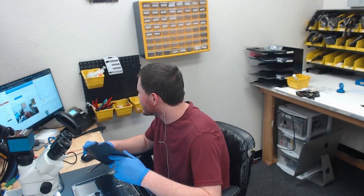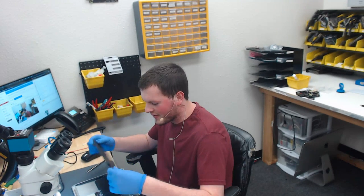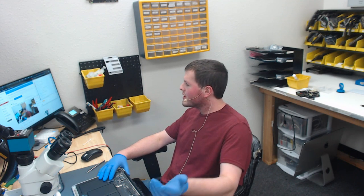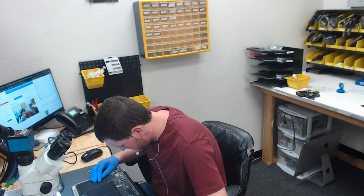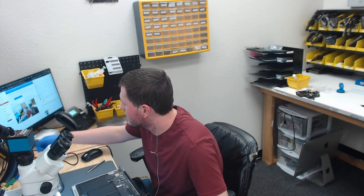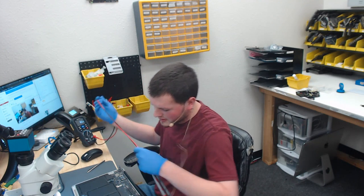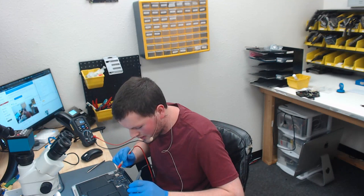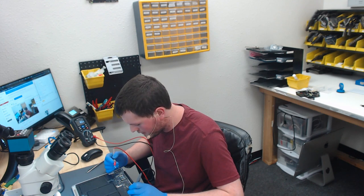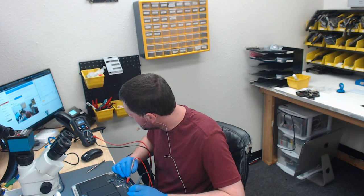Do you ever hear of MacBook Pro not crashing or crashing every day at 7:30 a.m.? I don't think the 7:30 a.m. has anything to do with it. Is it a late 2013 or early 2013? What year is it? If it's a late 2013 to 2015, replace the CPU MOSFETs with FMDF6807s, like a... No, this is fine. Mid-2014, replace the CPU MOSFETs.